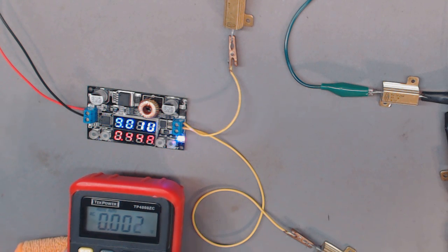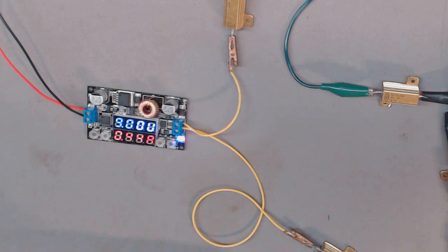What I plan on doing next is testing a laptop power supply — the bricks. They generally put out DC in most cases, typically 15 to 18 volts. This converter will take up to 32 volts input, and I'd down-convert it to 9 volts. The question is: how much ripple do those laptop bricks have?